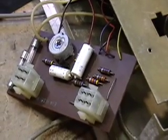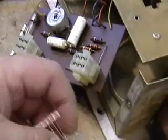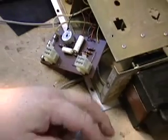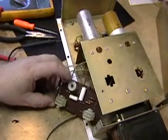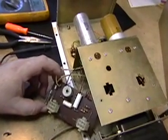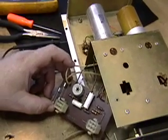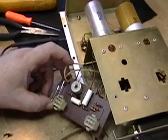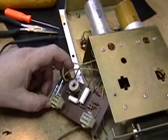And by the way, neither will the preamp in the Rhodes itself. So therefore, you'll get no sound at all, and that's going to affect you. This potentiometer right here is the 24 volt adjustment. Anything from 24 to 27 is okay, but anything above or below that is going to be a problem.